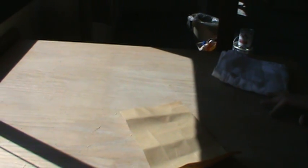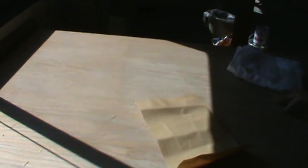That's the project for later today. But in the meantime, I'm going to get the stain on this table — it's a golden oak stain. I'm going to paint both chairs again and probably will have enough for a third coat tomorrow morning. I've already sanded the table using 220 sandpaper.